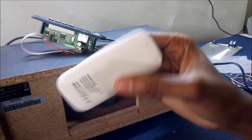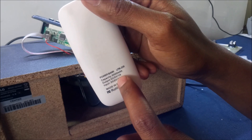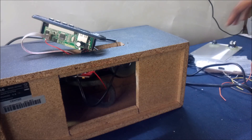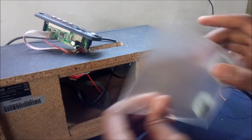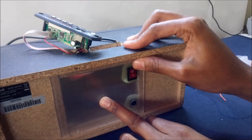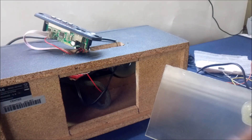For the battery unit I'm going to use this — it's a power bank I had lying around. It's 5000 mAh and produces one ampere, just like the transformer. I've replaced the round hole with a neat rectangular hole, and I have a switch and a charging terminal to cover it. I think I'll paint this. Let's get on with the work.